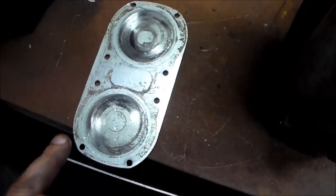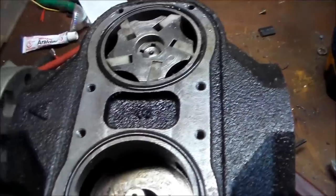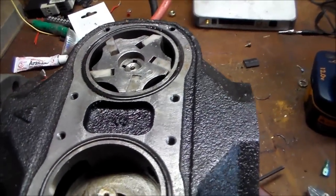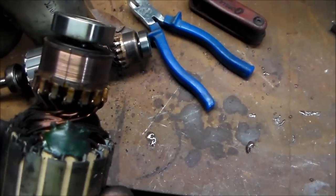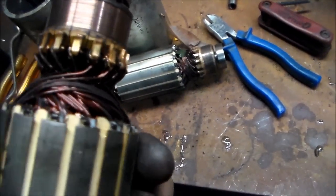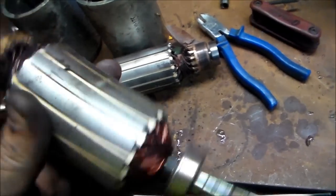Something to notice is that the rotors have worn somewhat on the housing, even though it was pumping diesel which is a rather good lubricant, and it still seems to have done some damage. Overall these pump motors don't seem as bad as I thought. They've definitely taken some heat — I don't know if they just got overloaded or what. But I've seen much worse, and the bearings are still fine.